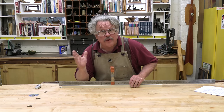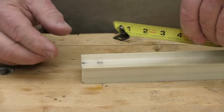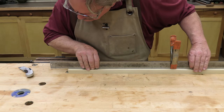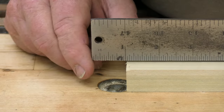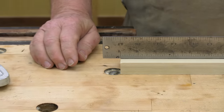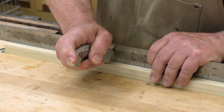That's why I like to stand up a ruler like this whenever I need to be dead-on accurate — with the lines actually adjacent to the wood, there's no parallax to worry about. Try not to include the end of the ruler or your tape measure in your measurements; it may be damaged or mismarked. Instead, line up one of the first marks on your measuring tool with the end of the stick and measure from there. In my case, I'm lining up the one-inch mark, so I just subtract one inch from the measurements on the ruler.